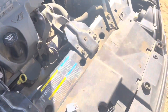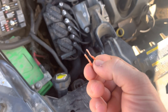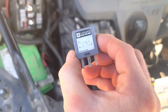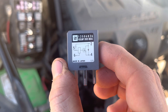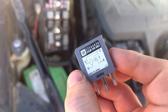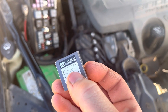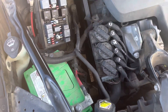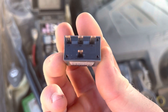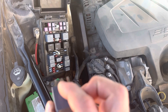I'm going to show you how to jump this relay if your relay goes bad. I got a piece of wire and cut off some of the insulated part with a knife. On this relay, it shows from 4 to 2 is when you need to get power. When this relay energizes from 5 and 6, terminals 2 and 4 will then have power. But when this relay goes bad, the power doesn't go from 2 to 4. So we're going to jump the terminals from 2 to 4 — on your relay that's the left top and then middle top.